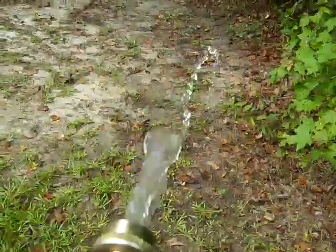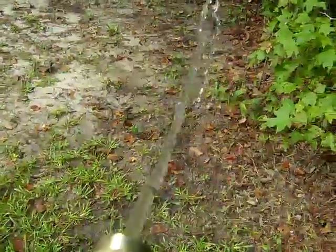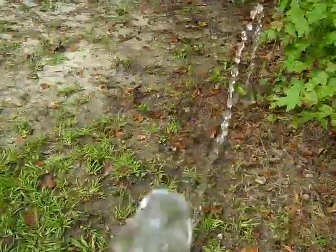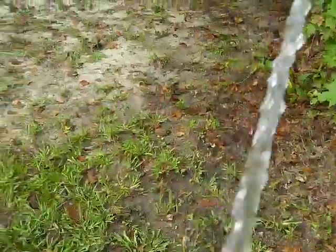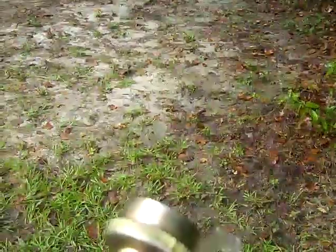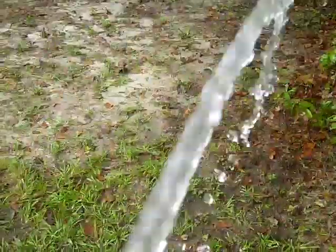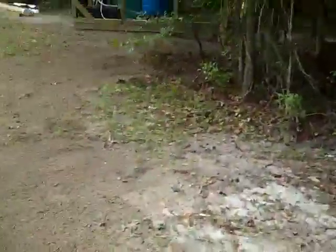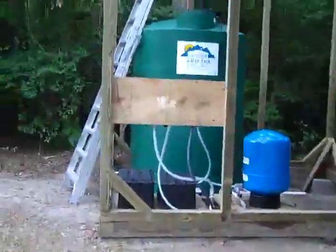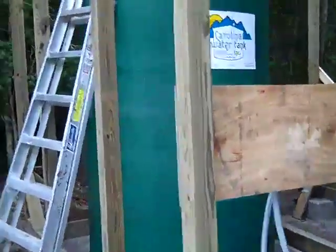As you can see, plenty of water just hand pumping — at least 5 gallons a minute. That's the beauty of the simple pump. We can also directly connect this to the bladder tank in the building and pressurize it for showers and to run a portable propane shower unit. It can also backfill and feed the line we put in to fill that green tank.